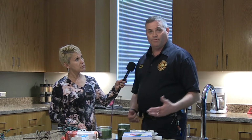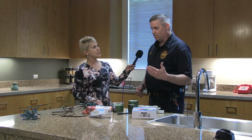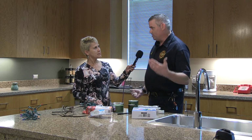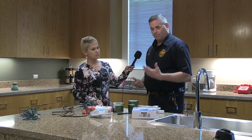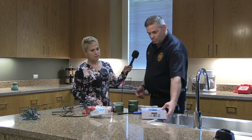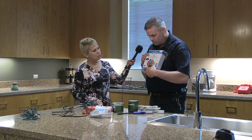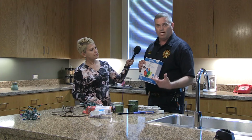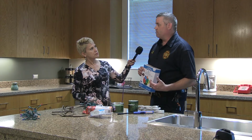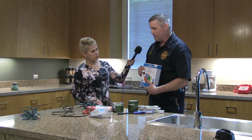There's several. The first one I would talk about is going to be our outside lighting and decorating. We want to make sure we're using the correct lights, checking our lights, and using our proper extension cords. If you're going to be choosing lights outside, when you go to the store to buy them, they'll indicate on the box, right here on the bottom, that they're for indoor and outdoor use. If you're getting lights for your outside, you want to make sure they're rated to be outside. So always look on the box to make sure that they can be used outside.